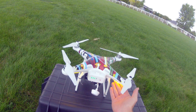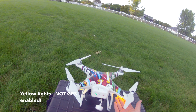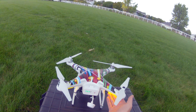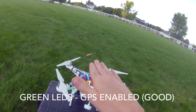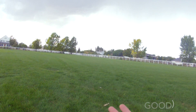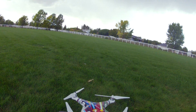If you chose to take off now, you'd be flying in attitude mode, which means it'll drift with the wind — when you push forward and let go of the stick, it's going to continue to drift forward. When you're flying GPS-enabled, it allows you to let go of your sticks and it'll hover. It also has a home point so that in the event you need the fail-safe return-to-home, it will come back and land in this area.